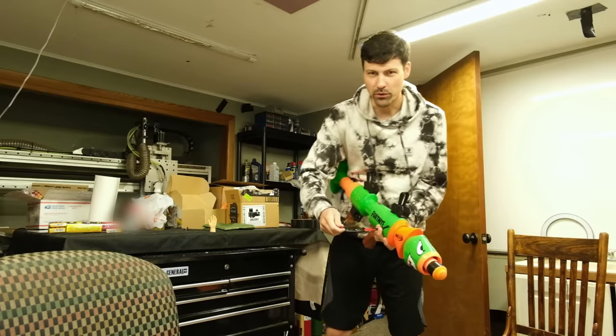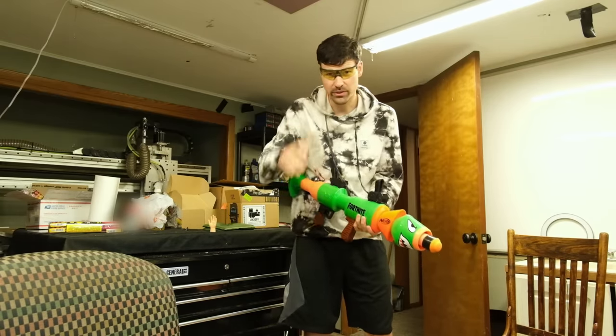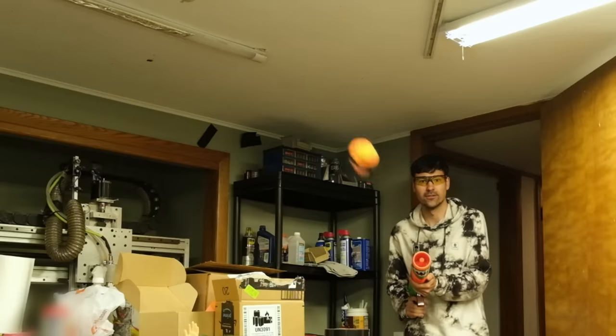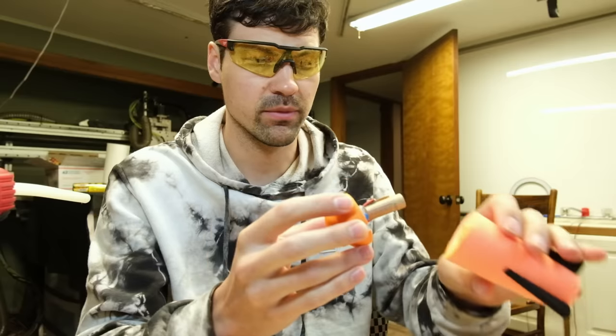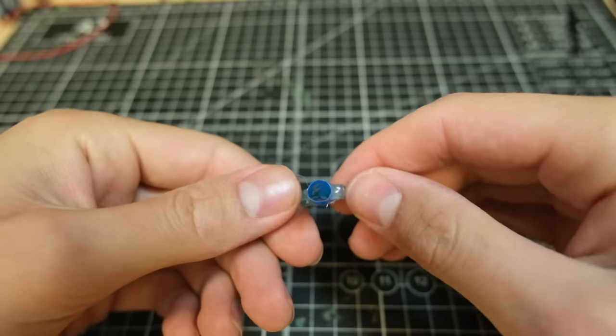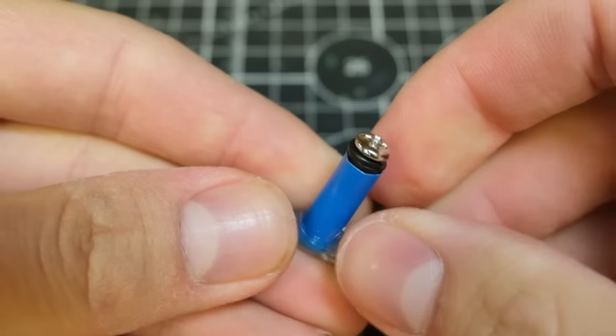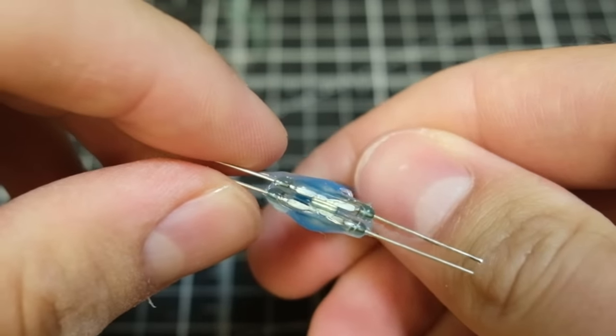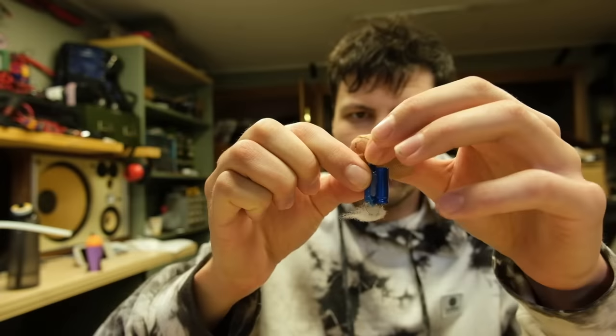This guy's loaded with the charge — this is more of an indicator than an actual source of thrust at the moment. It was like, thump, pop! This basic switch showed that it could use the force of a launch to activate a rocket fuse, and I was both excited and terrified to test it. Inside the straw is a magnet. The bottom is a magnetic switch, and the top is a screw inside a couple of plastic nuts. The magnet sticks to the screw until bumped hard enough to fall down to the magnetic switch, and the sensitivity can be adjusted by turning the screw. Simple.